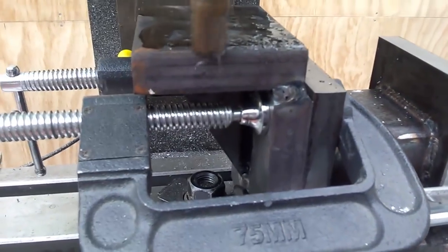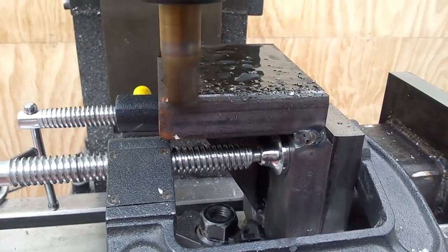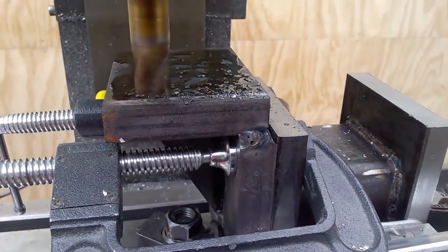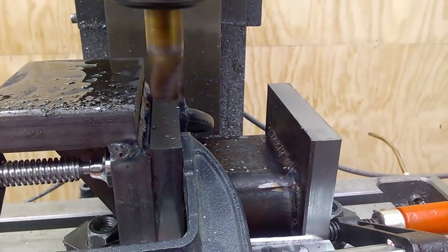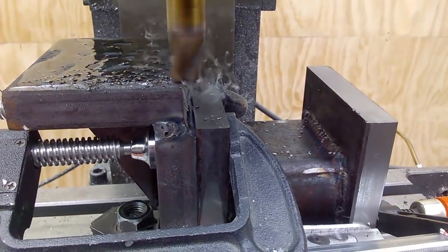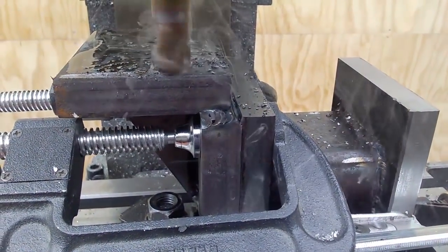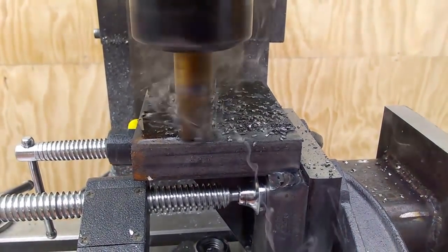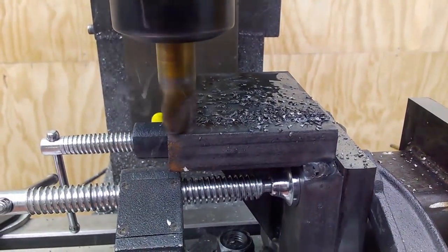This is a program I wrote by hand, just for practice — I'm trying to get more into CNC milling. The cutter I'm using is an old Soviet stock cutter from T1 high-speed steel. T1 was like the first version of high-performance steel because it has a lot of tungsten in it — I believe it has 18 percent tungsten in the alloy — and it's also coated in titanium aluminum nitride.